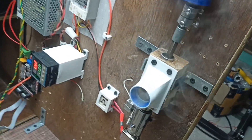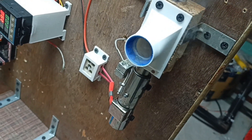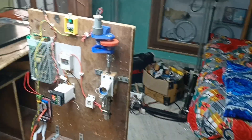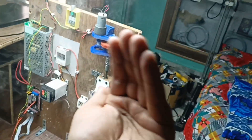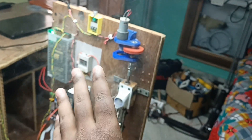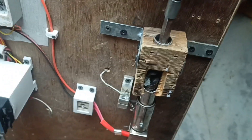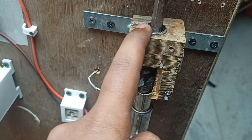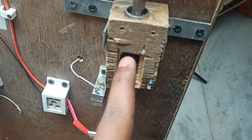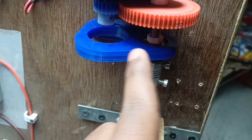The first trial didn't go well — it created a lot of smoke. I think there was a lot of dust inside it. I had to move it outside my room so it wouldn't get toxic. The problem was that the pellets were unable to feed through properly because of the 90-degree angle. I'm going to go on my laptop and design a new one.